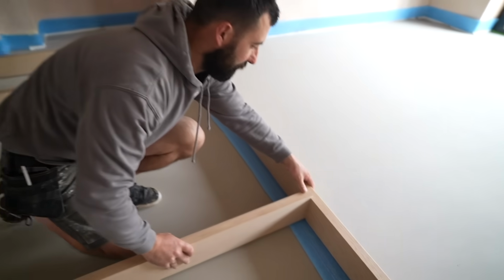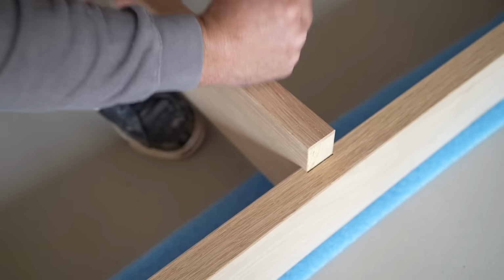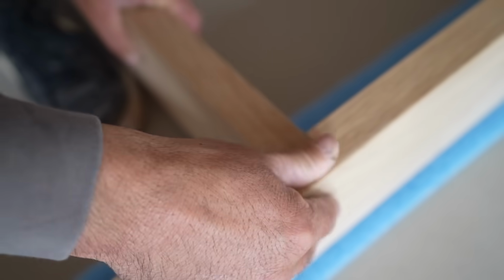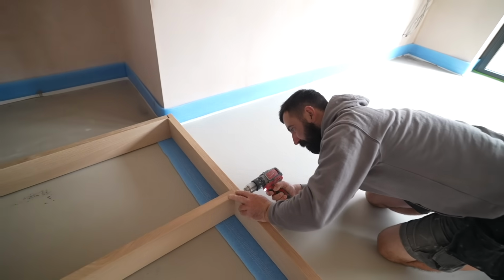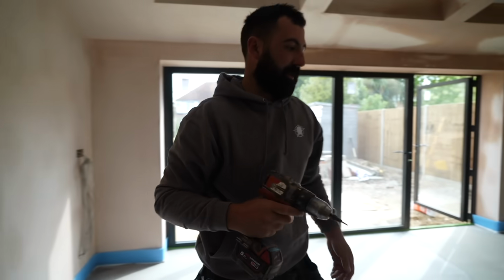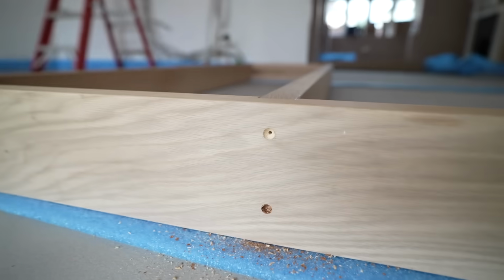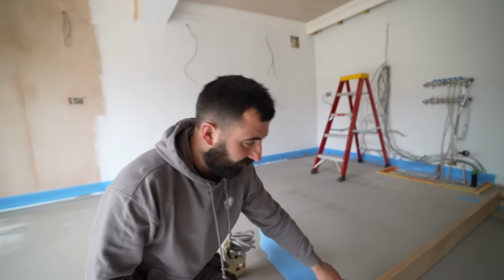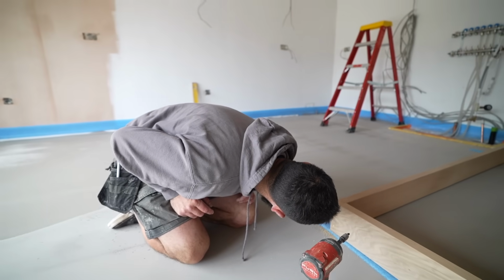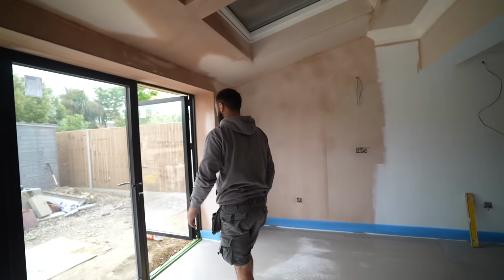That's how the other one should have gone in there. Nice fit that. Lovely jubbly. Just pre-drilling and countersinking, see on the top there, just for the fixing through onto there. Then the screw will go nicely into the oak. Okay. So, I think it's just an oak veneer looking at it. Don't think it's actually solid oak. Did feel like solid oak with it.